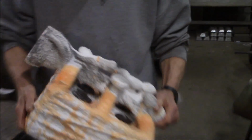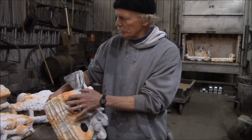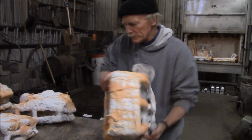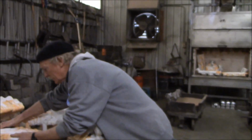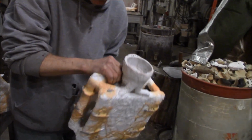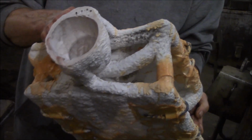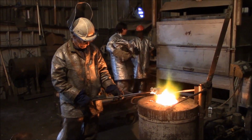The wax is all gone. The orange is where we put on some fiberglass dipped in some slurry to plug up holes. We had some relief holes on here. I don't think we had any cracks. But, so this is the lid and the extra lid on it. We clipped the edges of that too. Randy has at least. And he's put some extra little reinforcing fiberglass and slurry on there too. So we're gonna pour these this afternoon.